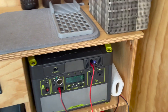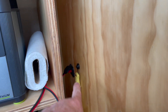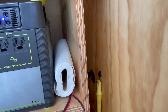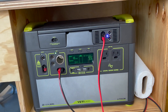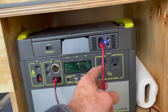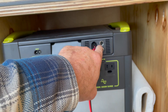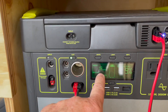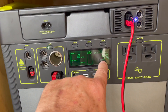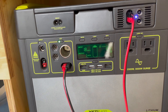The way I have it set up, you can see this plug back here — the line from the solar panels comes through the conduit under the deck, up into the container, and then I have a dedicated plug which plugs into the solar controller. You can see with the blue indicator that it's actively receiving; right now we're getting 18 watts and we're charging. I've been up here all weekend so I'm down at 9%.